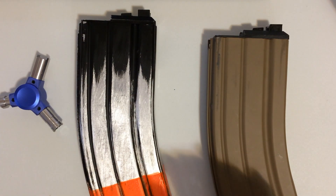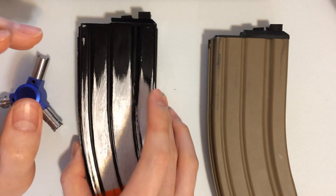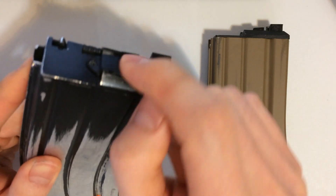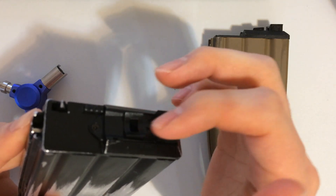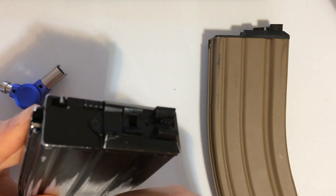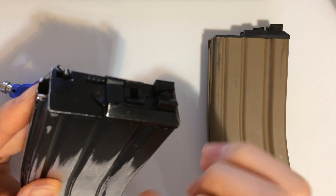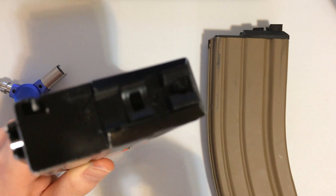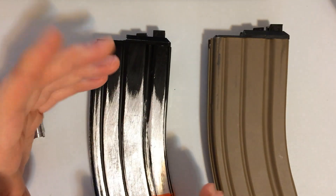So what we're going to try to do is fix them. But more importantly, we want to know the dimensions of the O-rings. The quick fix — without even having to take it apart — is basically you fill up the fill valve right here with silicone oil and let it sit overnight. The thought process is that the oil soaks into the release valve O-rings and causes them to swell up. After leaving that for about 24 to 48 hours, you pour out the silicone oil and the seals are all swollen up again and good to go. That's the simple solution — if you're lucky.